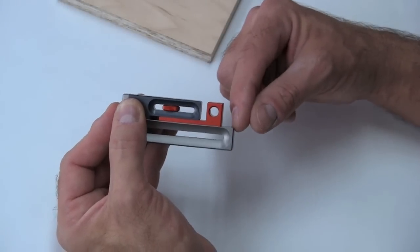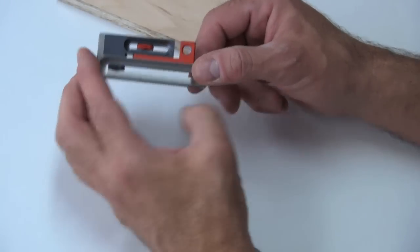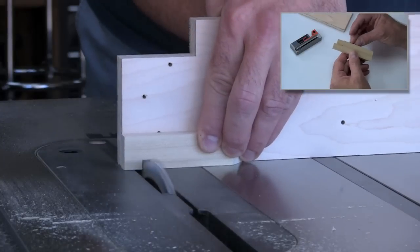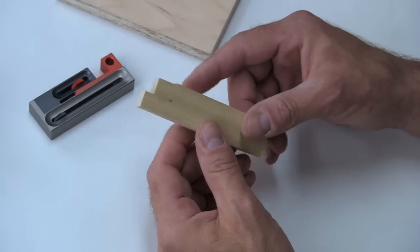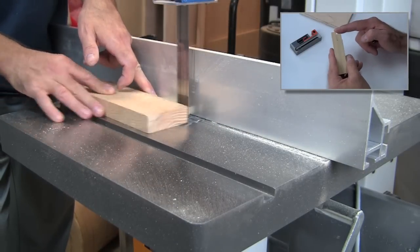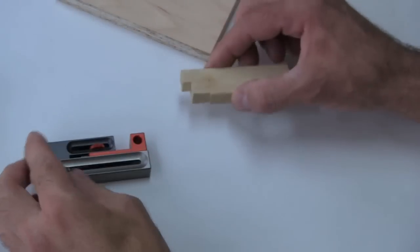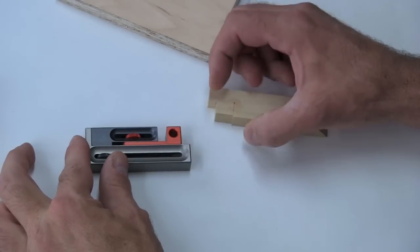You need this to be accurate. I'll show you how you can set this very accurately from the material that you're cutting. This is a setup block I've made from my quarter inch dado stack. I'm making a kerf using the dado stack itself, so if it's not exactly a quarter inch, it doesn't matter — I'm going to have that exactly on my block. Then I use a bandsaw to rip a straight part off to take off the piece that was previously near the end and slide it down, so now I've moved the kerf so that it's on the tip of this board.